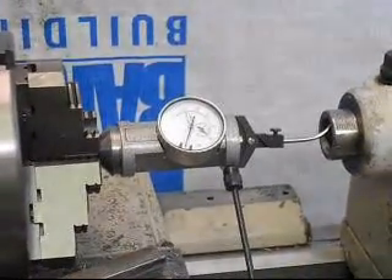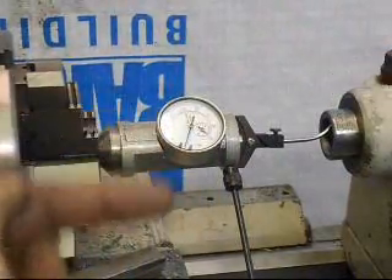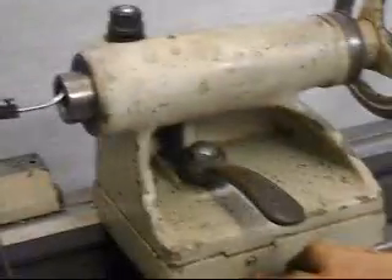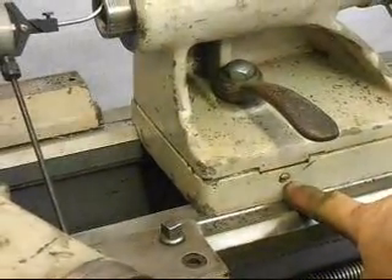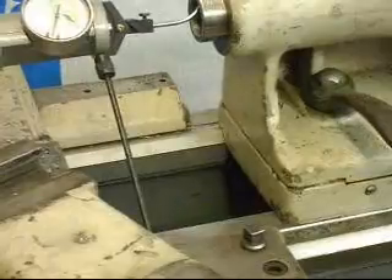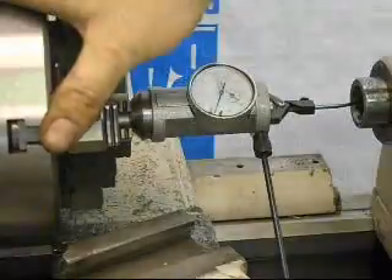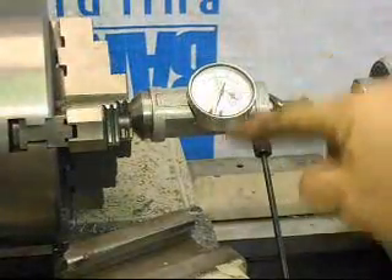That's great. The front and back alignment is controlled by the set-over screws, which are easily adjustable. Here we're at about zero on our indicator again — about zero. So total misalignment looks to be around maybe a thousandth between the tailstock socket and the centerline of the chuck.